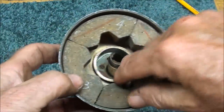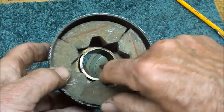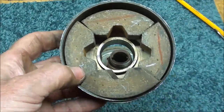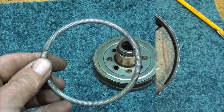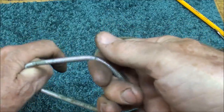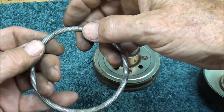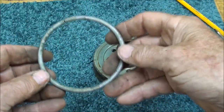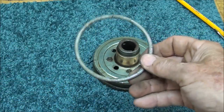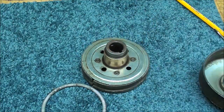That's what they look like reassembled. You can see there isn't very much space between the shoe and the drum. Now I'll put it back together. While I had it apart, I was checking the springiness or the stretch — this is a very hard-to-stretch spring, so it's relatively heavy wire. That would have had to have been carefully engineered, probably by experimentation too, to get it to be just the right tension so that the clutch would engage around 1800 RPM.